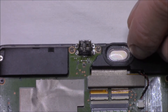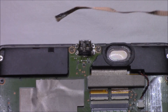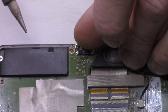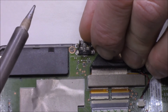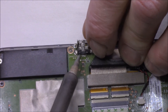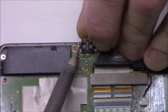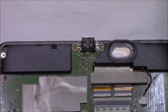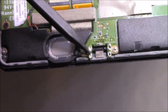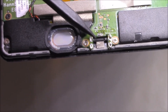I've actually found it quite difficult to remove with either the solder sucker or the solder wick. So what I've done is gently apply pressure with my fingernail in the charge port and just gently lift, going backwards and forwards on the solder. Keeping in mind that we've cut those terminals on the back so we don't have to necessarily worry about that — just gently lifting it up with a tiny bit of pressure, not too much, and it pops up out of place and should be all good. I'll just check on the back there and make sure that those terminals have been cut cleanly through before I pull it up any higher. As you can see, I've managed to get it off okay. I'll tidy up these areas here — those little terminal connections are okay. There was one that wasn't too fantastic, but it's come off okay.